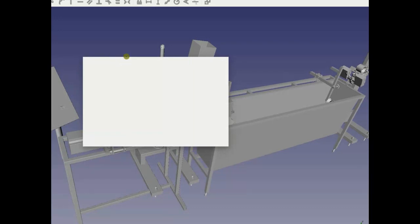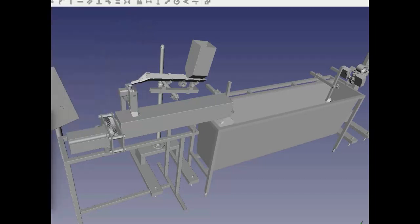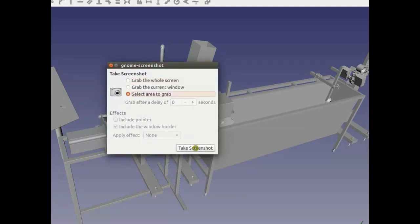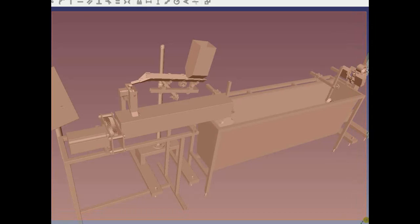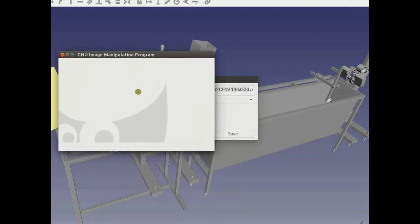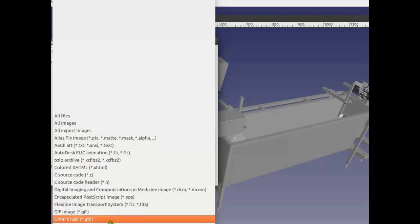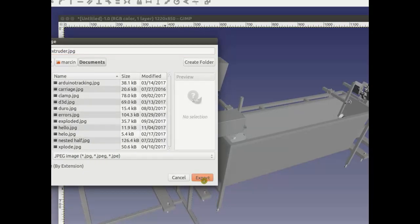The main herringbone gears probably also slow things way down. The rebuild time on those gears in SolidWorks is like 10 minutes — if you change the file and it recalculates, the curved teeth are very complex. The good news is we are dumping the herringbone gears — they were not necessary. That's kind of the main lesson on the diameter sensor: while it is cheap, it's not perfect and it takes some time to calibrate.